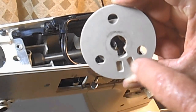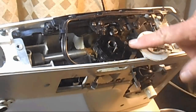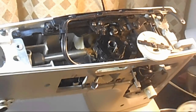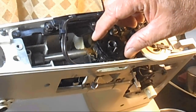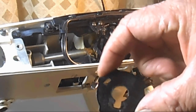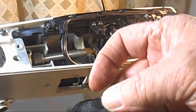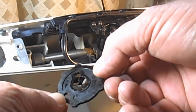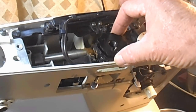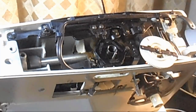You can see it's kind of like a little keyhole, and that keyhole opening fits over the pin that's on the cam stack — a little silver pin. With the selector wheel off we can now take out the cams. There are two physical cams; the top one is I think for the blind hem. The writing and printing is on the bottom, the smooth face is up, and it's got the same keyhole pattern that goes over the same pin.